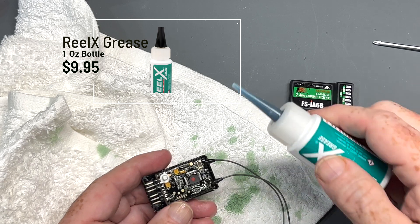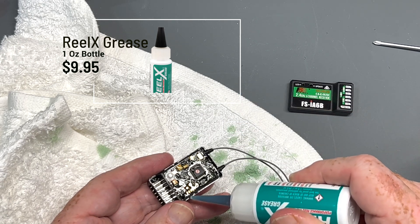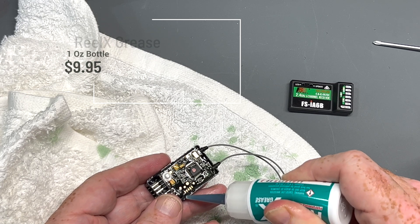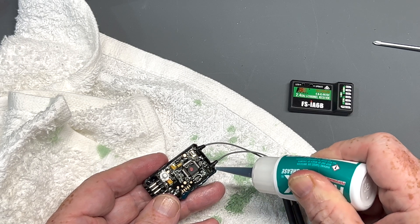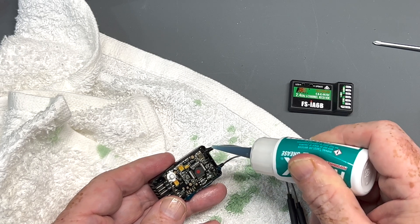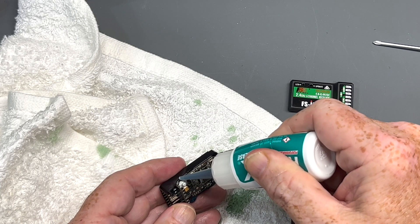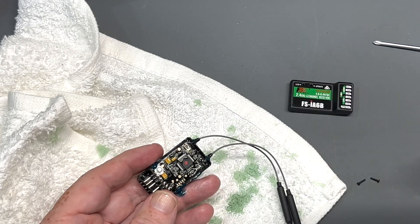What I also like to do is seal up around the motherboard, and for that I'll use the marine grease to stop water from getting in there, once we've actually used Corrosion X to waterproof it. Because it can't hurt the electronics, use a little bit of marine grease right around the ends of the tube and around the case, just to keep it sealed up.